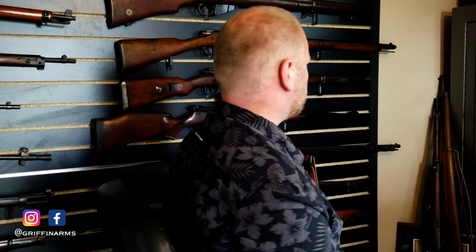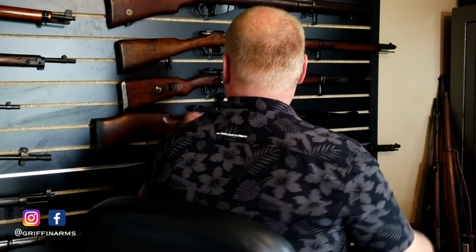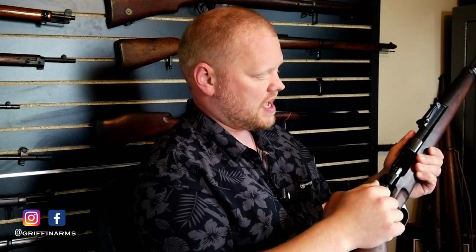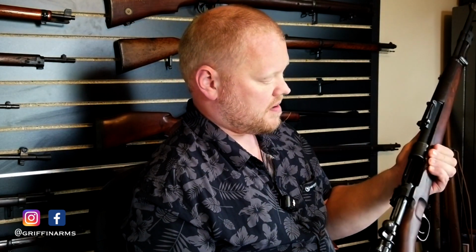We then graduate during World War II, and just slightly before that, to a carbine, the K98, which is the most famous of Mausers, as it led through all of World War II and had a controlled round feed bolt that would pick up each round and then put those rounds directly into the chamber. This became very, very popular with hunting and sporting, especially dangerous game, as push feed guns would sometimes lose their ammunition out of the magazine during transition of the bolt. This, however, will not do that.